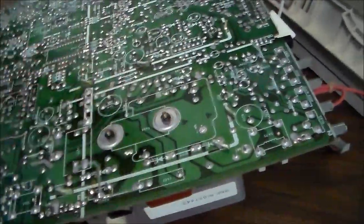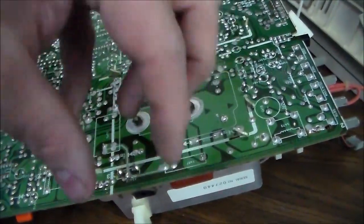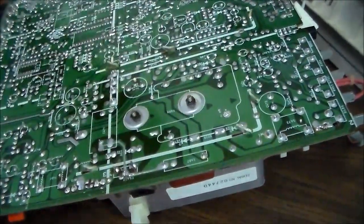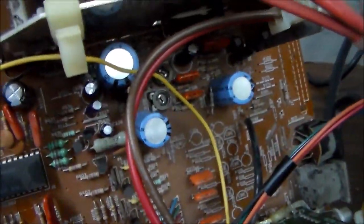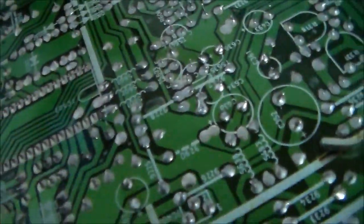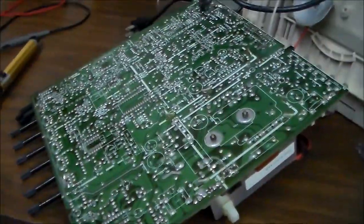So anyway, that needs new solder — that could have been the whole problem. You want to look for that anywhere there's something that can move, like the flyback is soldered down to the board, and if it ever wiggles, the weight from the flyback could break that loose. Sometimes it's just because of heat or whatever. The flyback itself actually looks pretty good — this stuff on the top is just glue, no big deal. We replaced almost all of the caps. You can see three that we couldn't because we ran out of one type and didn't have the other, but I'm going to put it back together, solder the plate back on, put it all back in the machine, and we'll try it out.